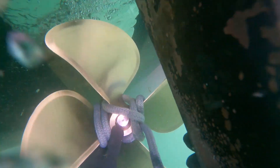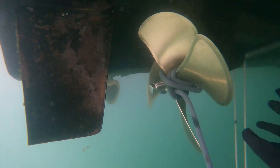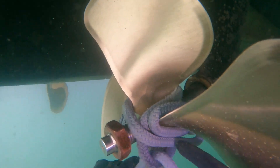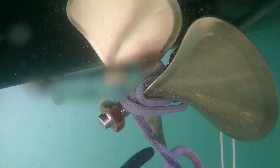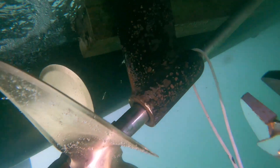Now let's grab the new prop, fit it in there, and take a look. This prop felt nice and tight — it was actually close to being seated to our original mark, and once we tighten these prop nuts down it is going to force the prop to sit right at our mark. In some cases you may have to take the prop back off, file down the key, and slide the prop back on — you may have to redo this process a couple of times, but we got pretty fortunate. So we'll hang our tools and slide the block back up to continue tightening down the prop nuts.